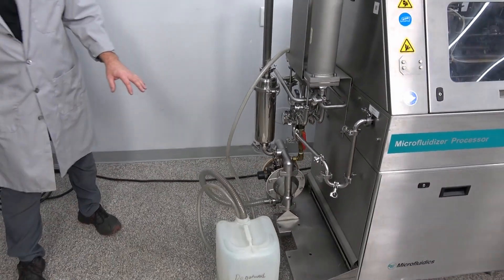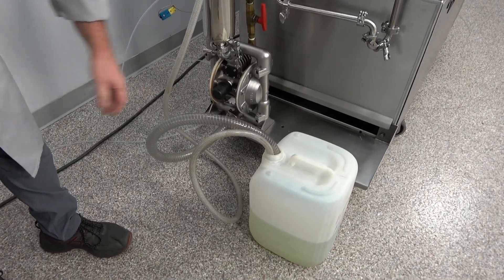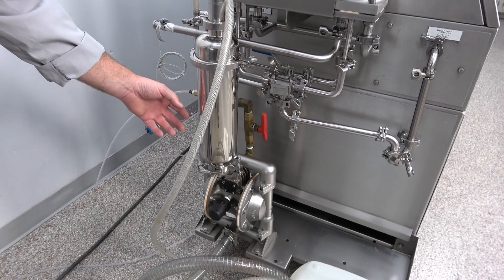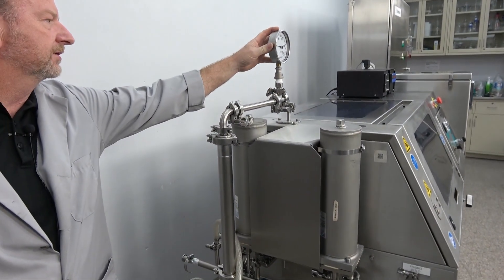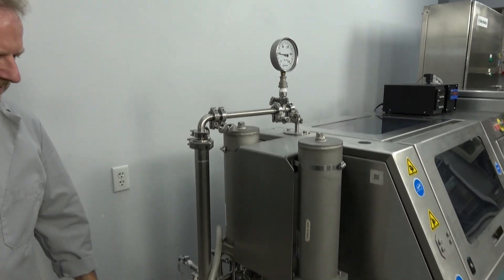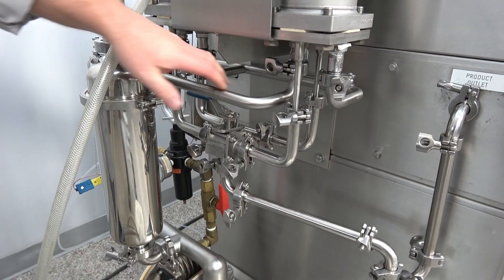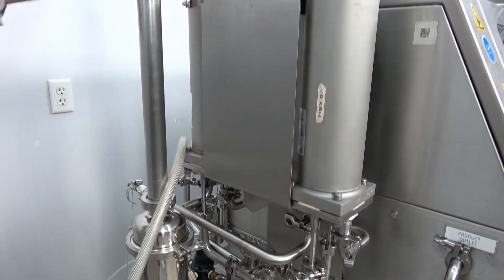We'll come around here — you can see all the plumbing. Right now we have a big draw tube coming into the bottom of our diaphragm pump, and it's pumping out alcohol, bringing it up through this strainer which has a 200 micron filter in it right now, just filtering out any large particles. Then it pumps up here, comes over here past the pressure gauge, and drops down into your pumping cavity inside. Over here you can see the product outlets coming out, and then up to a valve where you can switch directions.